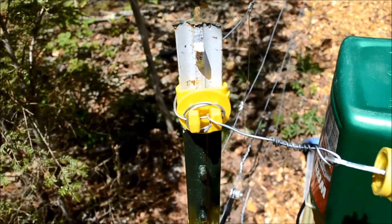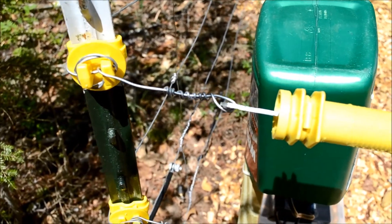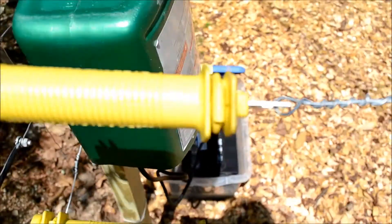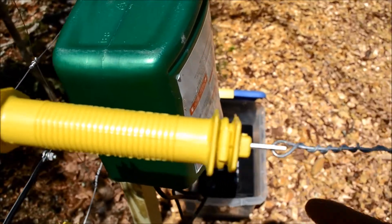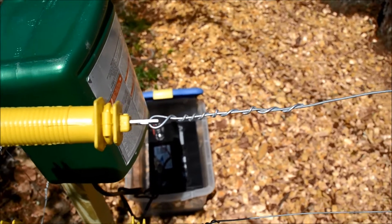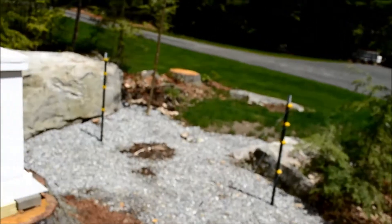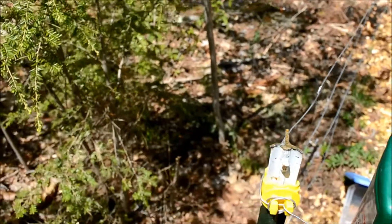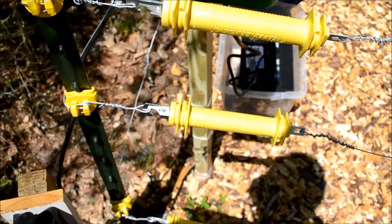If you look carefully at the insulator, you'll see that I've wrapped the 14-gauge wire around the end of the insulator a couple of times and extended it out about two or three inches with a loop on it. That way my handle can clip right onto it. On the other side, the conducting clip travels right through the handle, and you connect the other side of the electric fence to the other side of the handle — basically one long loop around all four posts and then back in. I've done this on four separate loops around the entire fence.